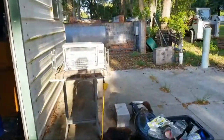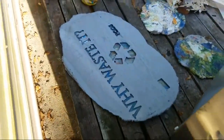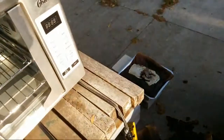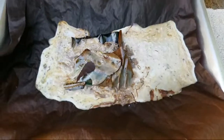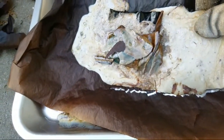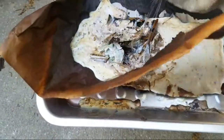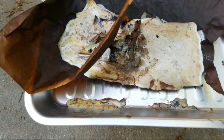In the oven: HDPE number two high-density polyethylene — yes, as we showed making that sign. LDPE or plastic bags — yes, as you can see we made those. Now we've tried PET at 450 Fahrenheit — it's 275 to 300 for the others — and you can see it's brittle. I can feel it's going to crack in another second or two. It's just not a great material — and I've just ruined a bit of my glove, that's awful.